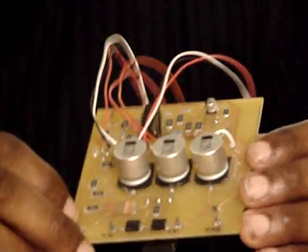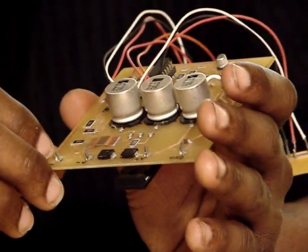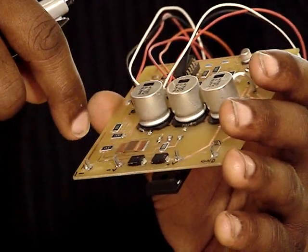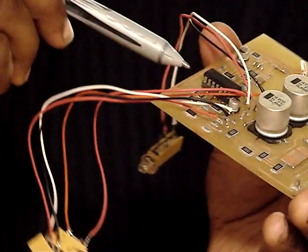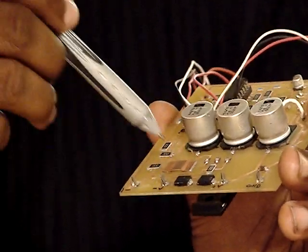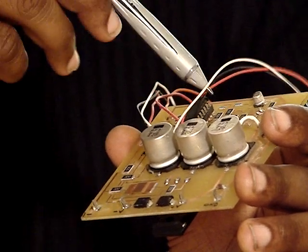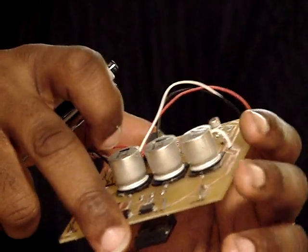As mentioned in the original video, this is not your everyday pulse width modulator quality-wise as far as performance. All of the components are surface mount with the exception of the LM324 op amp, but the socket it sits on is surface mount. Everything else is surface mount — the diodes, the current sensing resistor, the electrolytic capacitors, non-polarized capacitors — everything. The resistors have a 1% tolerance rating, the non-polarized capacitors 5%, and the electrolytic capacitors 10%, with low ESR on those as well.